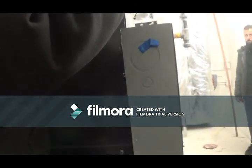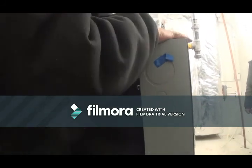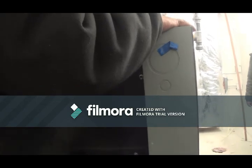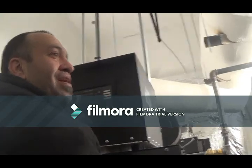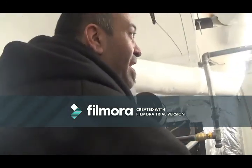Whatever the case may be, if we had cam lock, then there would be a secondary breaker where we would have it off, and when we needed to transfer, we'd just turn one breaker on, the other one off, and hook up the generator. This particular unit does not have cam lock. Just ahead of time, I might let you know that our technicians most likely will recommend putting in the cam locks, and the reason being, in the long run, you will save the life of this. So that's more like an option.